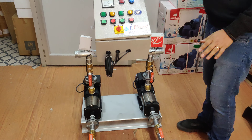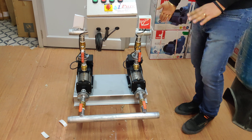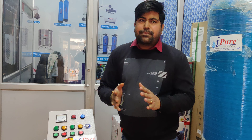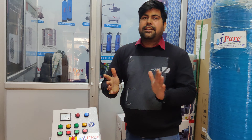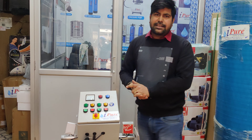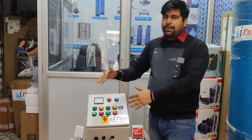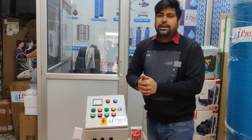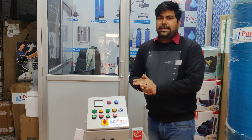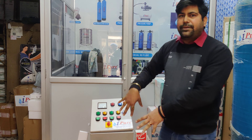If we talk about functioning, this is the simple inlet and this is the outlet. In this line we have a pressure tank, and this is the whole function. It will automatically function — if you have 20, 30, or 10 bathrooms, we put two pressure switches. What does the pressure switch do? If one pump can handle 5 bathrooms, then when 6, 7, or 8 bathrooms open, automatically the other pump will start. We call this a variable drive system — VFD pump. This is a different concept but it works in a VFD-type way.